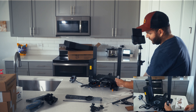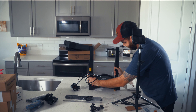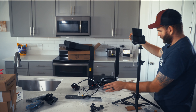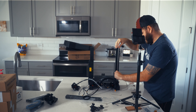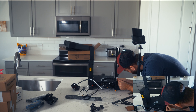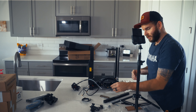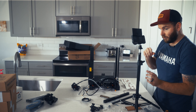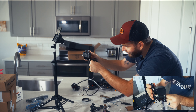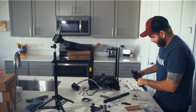The stepper motor goes to the back right here. We've got the stepper motor installed on the side. The next thing it calls for is putting in the Z-axis rail - that just goes in like so. Then we've got to tighten up these little screw fittings down at the bottom. The next piece we're actually going to install is assembling the printer head. This piece right here - this is one side of the stepper motor, and you've got to get these screws into this little area down here, then those are going to mount into the side here.